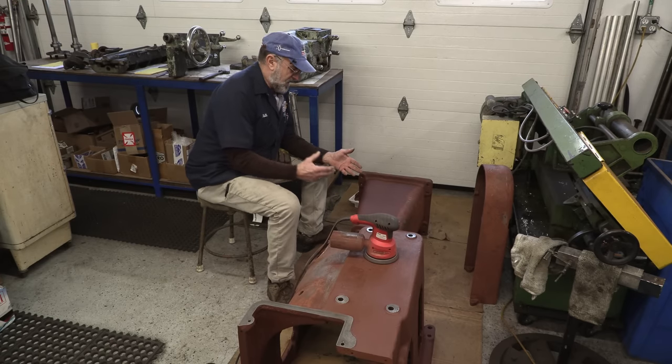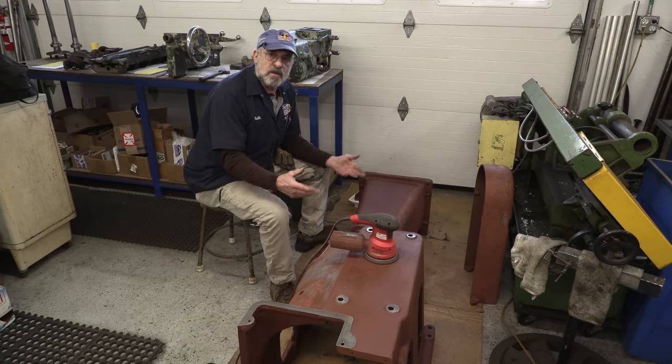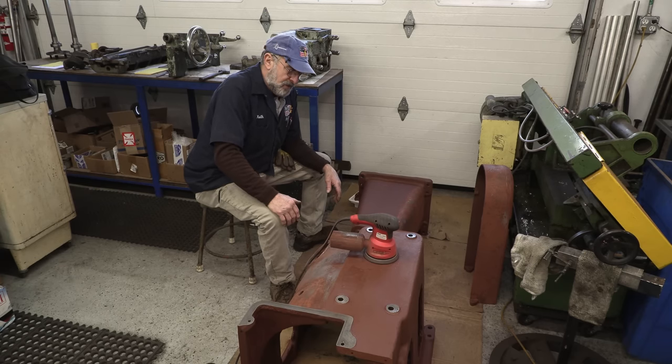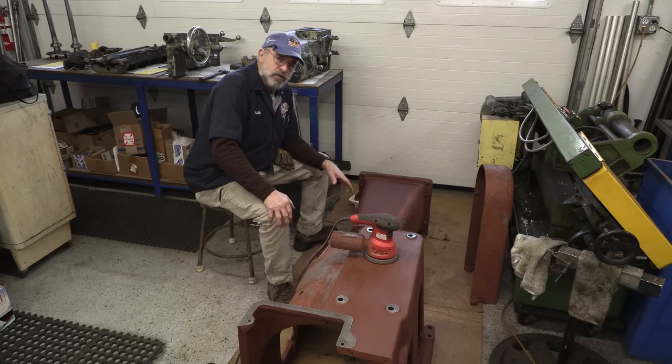I'm through the cleaning stage, and this is the first layer of rusty metal primer. Rusty metal primer is my choice for painting on any of my rebuilds or machining. It's a good bond. I've even painted the inside of gearboxes and just left the plain Rust-Oleum product inside, like on the K&T. Even when the gearboxes are opened up to do a repair or inspect anything, I have seen the interior just as brilliant as the day I put it together, and it holds up good.